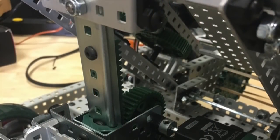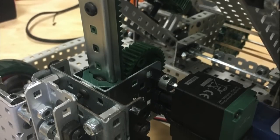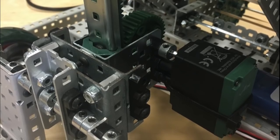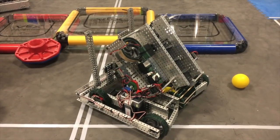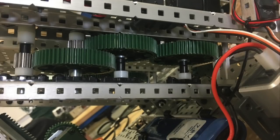The flywheels were aimable using a linear slide, similar to the one used in my tutorial video (link in the description), except using the newer slides which were wider. The slide had to be attached to both the chassis and the flywheel at a single pivot so it could change its angle dynamically, otherwise it would jam and would not move. It could have aimed up or down more, but the motor was kind of in the way, so it restricted the movement.